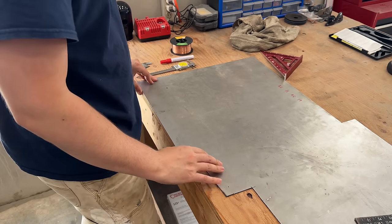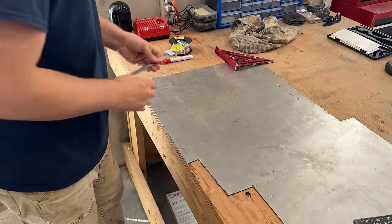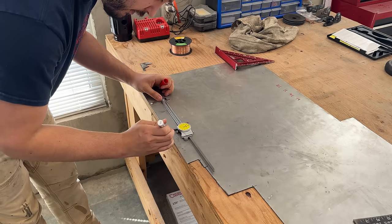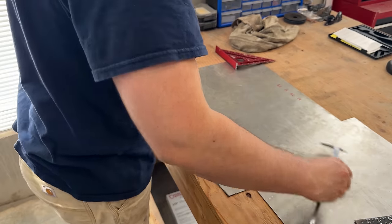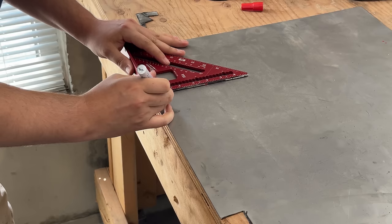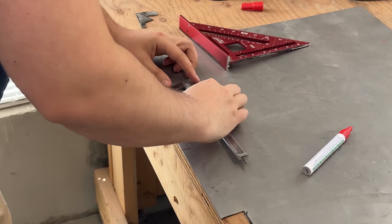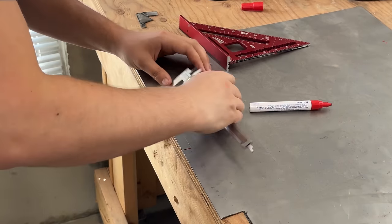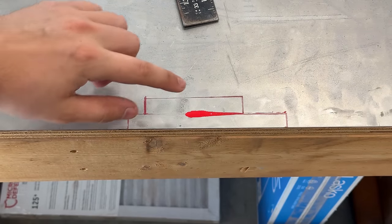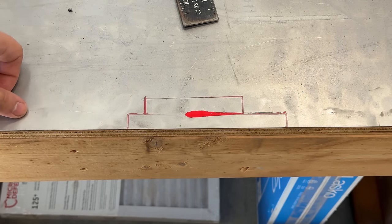So on this piece, I want to learn a little bit better how to shape metal. So I'm going to measure out first the tab, and it was about 150 and a bit. Lost my Sharpie. So about 15 millimeters off of this is where this starts. I need to learn to scribe. Then we are going up 19. So, as goofy as that is, I'm going to bend it 90 degrees on this line here. And it should fit right in.